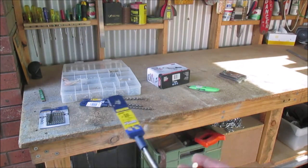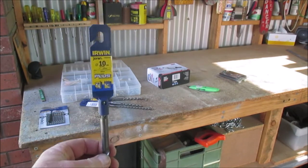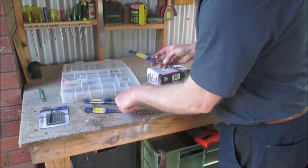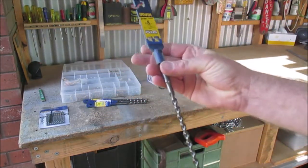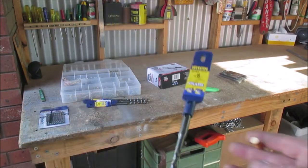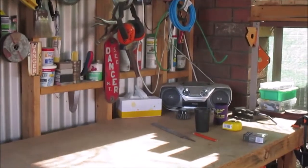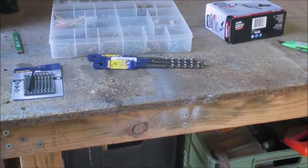The other week I went down to get some drill bits - I needed an SDS bit for the rotary hammer drill. These Irwin SDS shank bits are very good, five dollars each. I've got three 10-millimetre ones and a longer one - that's an 8-mil with a longer fluting on it, and that suits that blue stuff in the corner which is 8-mil spaghetti, just like raw plugs. Five dollars each - bargain, unreal.